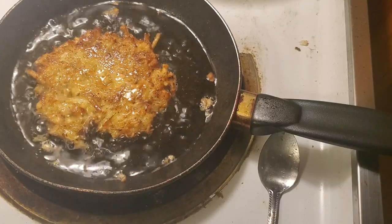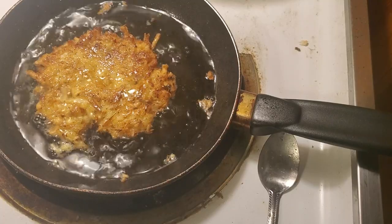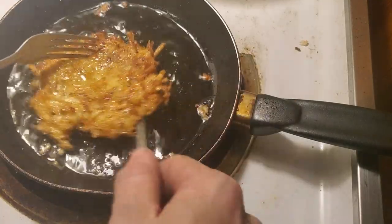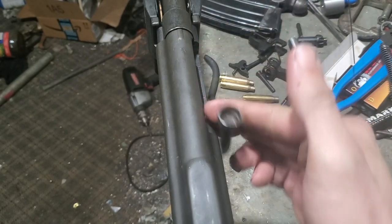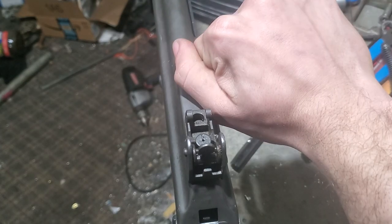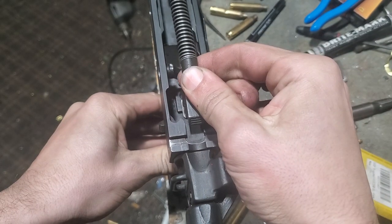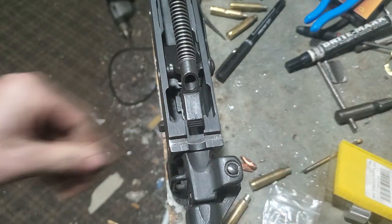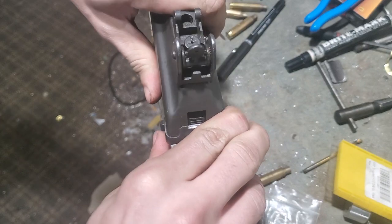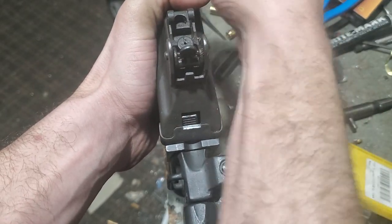This was a fun build. I like Galils, but people always talk them up like they're God's chosen rifles and just so perfect. I'm not a fan of the upswept charging handle. If you don't grab it just right, you smack your finger into the dust cover or the rear sight and it hurts. The mainspring with the extra long latch for the dust cover is a pain to get on too, because of the length. You need to balance the end of it on the flat spot inside the receiver, then put the cover on, and then cycle the bolt to move it into place.